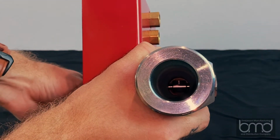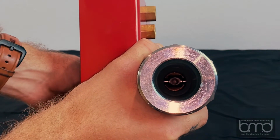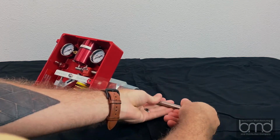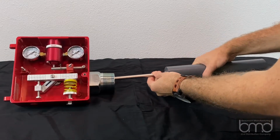If it is too far misaligned, you may need to push the dog leg up to the torque bar in order to realign it. Insert the arm into the end of the body and thread it into the shaft until it is tight. Next, thread the displacer onto the end of the arm.